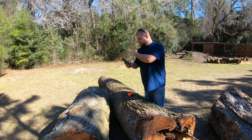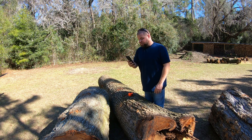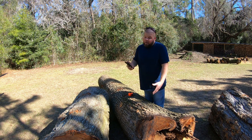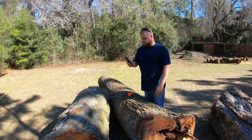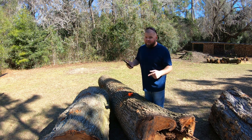It's 22 3/4 on that end, a little over 28 on this end. I just said 28 inches. And according to this, estimated weight is 2,441 pounds. My guess was 3,000. I don't know much about the tree, so I guess I'm pretty happy being about 500 or so pounds off. So 2,441, the tractor is only rated to lift 2,200 or 2,300 at the pins now.